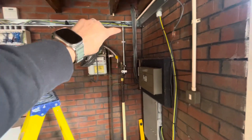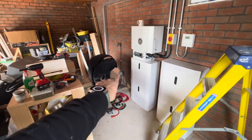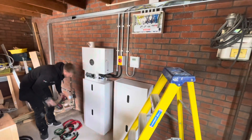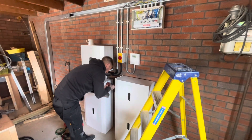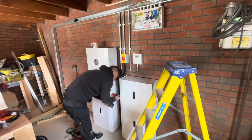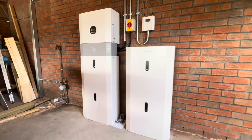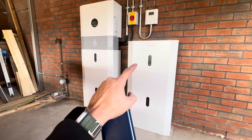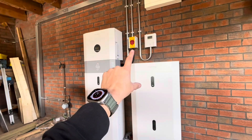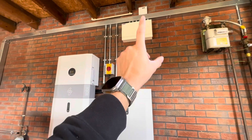It's part of the rewire — we still have bonding to go in here to bond the gas pipe, and there's a stub of galv over there to bond the water. That is the battery section for now and that is what we are focusing on. Another hour and a half and it should be commissioned. That is it all done and dusted as battery-only storage for now — 5, 10, 15, 20 kilowatt hours of storage.